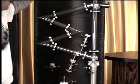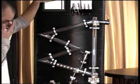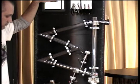He can hit the stage button, and it's a momentary, so he has to hold it until the ball is in position, and then he hits the release button, and that energizes the release solenoid and puts another ball into position ready for the next cycle.